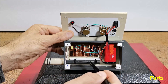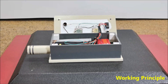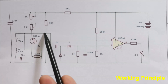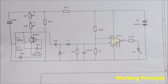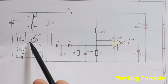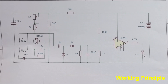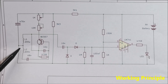These coils are wound on a ferrite core from an old AM receiver. Let me briefly explain the working principle. This part with one transistor and two coils represents an oscillator with a frequency of about 20 kHz. The amplitude of this sinusoidal signal can be changed in two ways: the first is by changing the value of the potentiometers, and the other is by bringing a metal object closer to the ferrite core on which the two coils are wound.